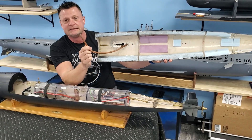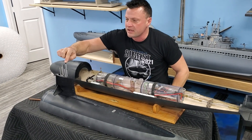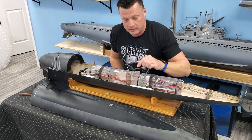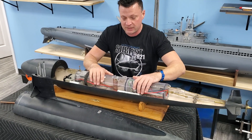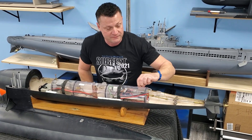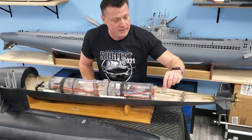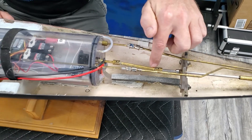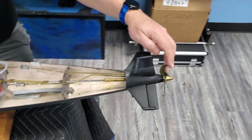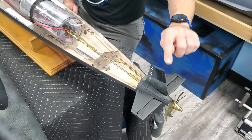The other thing is the air intake that runs up the mast right to the top of this particular periscope here, and that is how the model draws air in to blow the ballast tank. Taking a look at this cylinder, this is a scratch-built module that Dwayne has put together, following the same design methodology as many of his boats do. We've got magnetic couplers on the back here and a small intermediate shaft that runs to the propeller.